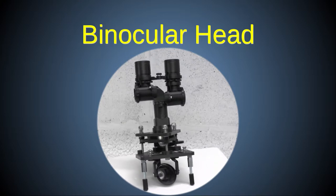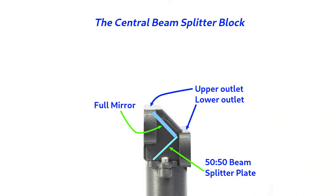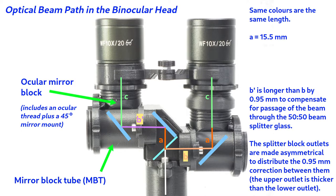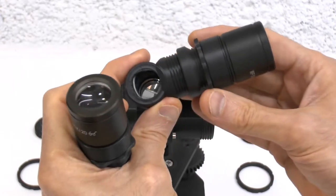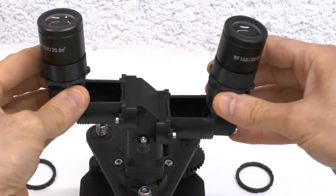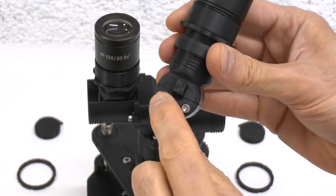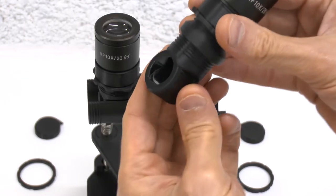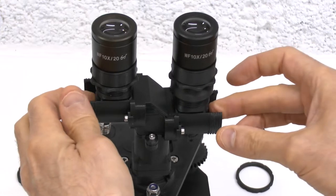If you're going to be looking down the microscope for long periods of time, it's much more comfortable to use both eyes simultaneously. This is why most professional microscopes have binocular heads. The basic optical path in the Puma binocular head was introduced in the video on beam splitters. In addition to the central beam splitter block, there are two 45-degree ocular mirror mounts that direct the image beam upwards to the oculars. The part that houses the 45-degree mirror is called the mirror block, and these fit into and slide along a mirror block tube (MBT) on each side, with a tri-screw mirror angle adjustment mechanism for fine alignment.